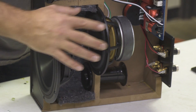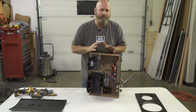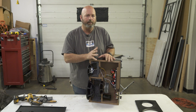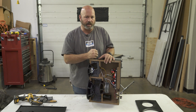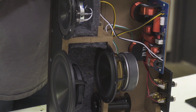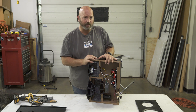So you're hearing the bass off the passive radiator, with some bass also coming off the bass driver inside. The benefit to that — anybody can design a ported speaker enclosure, which will make a pretty good amount of bass, but it might not be super tight or accurate bass. That's what Andrew Jones has accomplished here: with this design you get the benefit of a lot of bass from a smaller stand-mounted speaker, as well as it being controlled, tight, accurate bass that you're going to really like listening to.